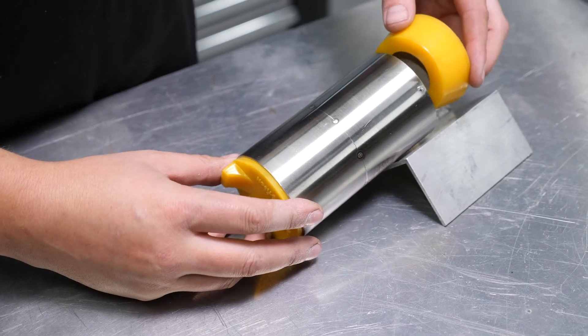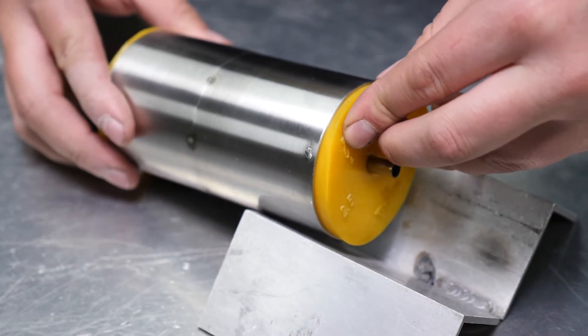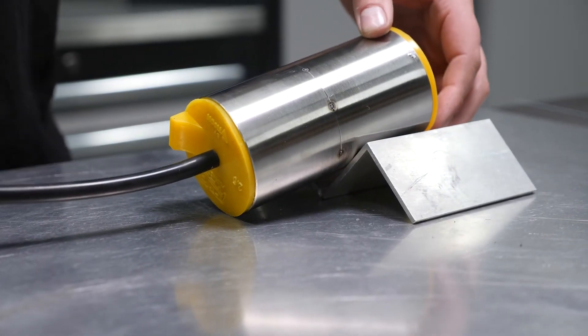Much closer and you risk damaging the silicon material from the heat generated by the weld. If the weld is a long way from the end of the tube, then masking tape will suffice as a cheap solution. We need to remember that argon is heavier than air, so we want to fill at the lowest point and vent from the highest point on the part we're welding.